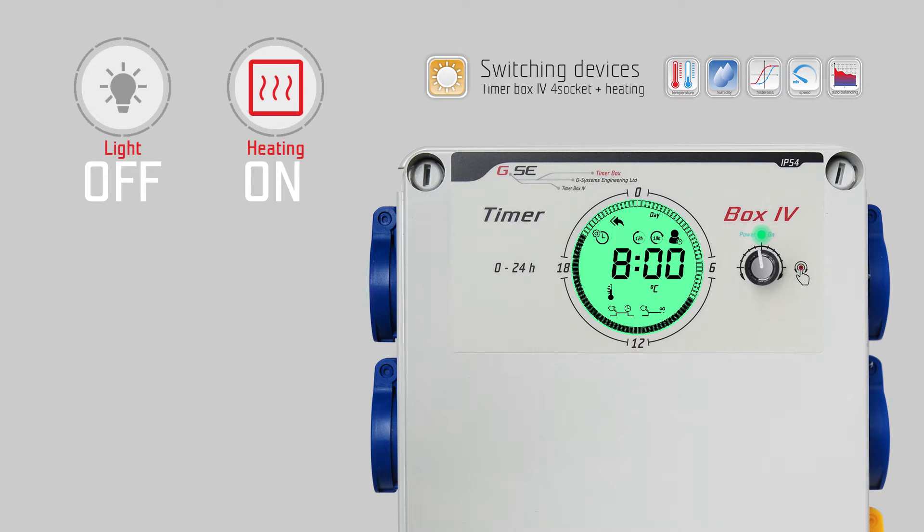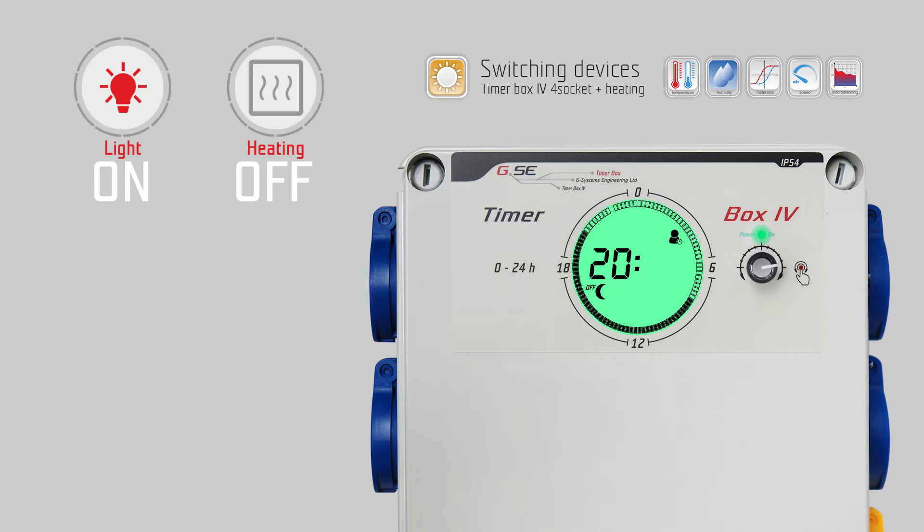Now you can choose the duration of your program. Turn right to go to the 12-hour cycle, which is set by default when you change the start on time. Turn right to go to the 18-hour cycle — when you choose 18 hours, push the encoder and 72 full segments will appear starting from the start on time. Turn right to go to the user off time and push the encoder. The moon symbol shines constantly indicating the OFF time. We set the hours and minutes of the user off time to 20 o'clock and push the encoder to save. The full segments appear starting from 8 o'clock and ending at 20 o'clock.